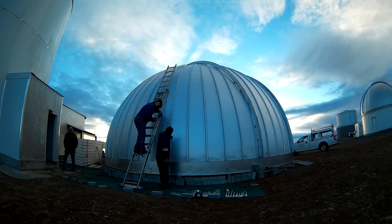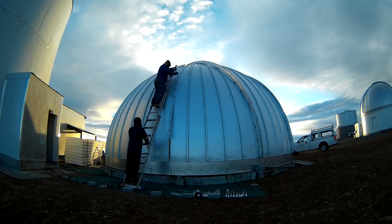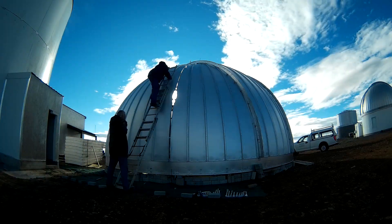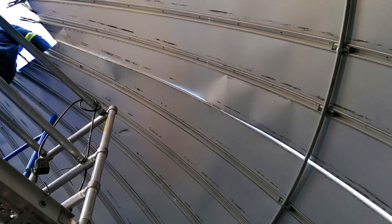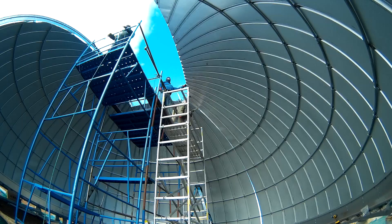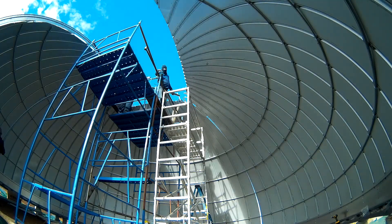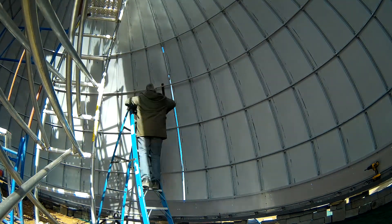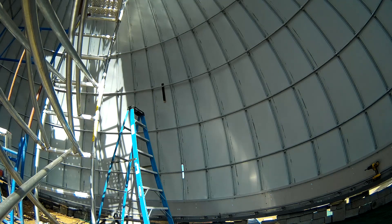Day 8, Monday: the third and last damaged rib proved impossible to twist out, so we effectively took it apart by grinding off and knocking out the rivets. Because it was damaged anyway it had to be replaced. Luckily ASCH Dome includes spares for such an event. The opening did not look very promising — very pinched towards the top — so I had very little hope we would be able to get the new rib in. This time we again sent in the leader, bent open the slots, and applied lots of lubrication. With Hein and Abel feeding the rib, Hugo pushing outwards using a plank to open up the gap, and me outside pulling on two ropes tied to the leader and the rib itself, it slid in amazingly easy. What a relief!